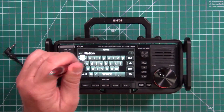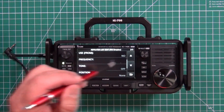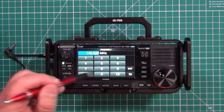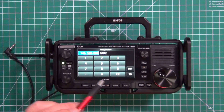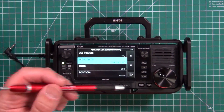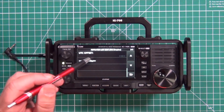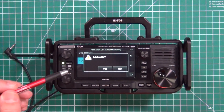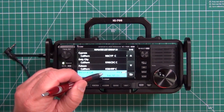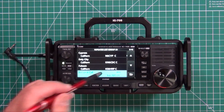Enter the name and hit enter. Don't have to worry about the sub name. Go down to frequency — it'll be 146.520, and don't forget to add extra zeros. Hit enter once you're done. You can do a position if you want, and a UTC offset, but again, this is simplex so it's not really going to matter much. Hit Add when you're done. There it is. For some reason it always shows up as Skip — press and hold to get the menu back up, go to the second page, Skip All Off, and you're all set.